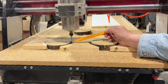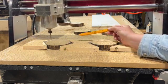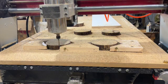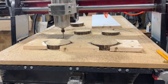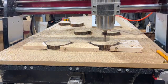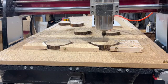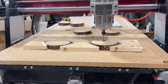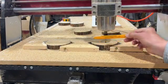It adds about 20 seconds, maybe 40 seconds to this program and this program, but it doesn't matter that much, because before I was hurrying back to replace each one. Now I can replace both of them, let it run for about 8 minutes, and they're both done. So it wastes the machine time, but it saves some people time. If you notice, it didn't start exactly in the center, but if I've compensated enough, it won't matter that much.